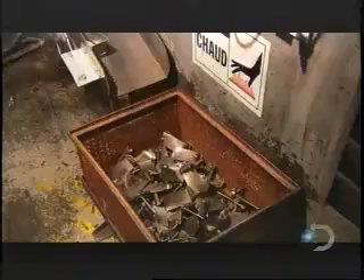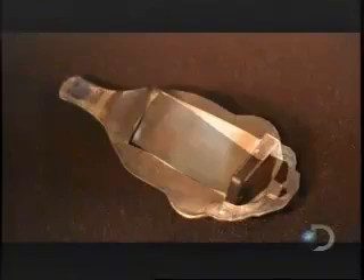Almost 1800 tons of pressure gives the airfoil its final shape. A trimmer shaves off the excess metal. The searing heat has turned the protective ceramic layer into glass — that will come off later. It's taken an hour to shape the blade's airfoil. The dovetail, that nub on the right, is next.